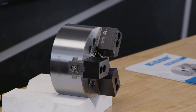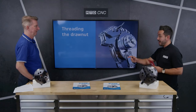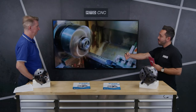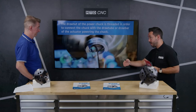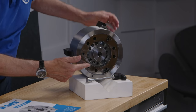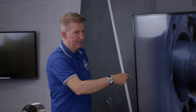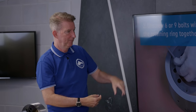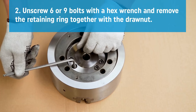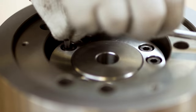Finally, to wrap up the how-to videos, we're going to look at how to thread a draw nut. You're quite heavily involved in power chucks — how important is this? The draw nut at the rear of the chuck has to be taken out: the bolts are removed, you take it out, and then the draw nut section is there. You then thread it to match the draw tube on the machine. This is how you get to that draw nut — and there you are, you can take it out.